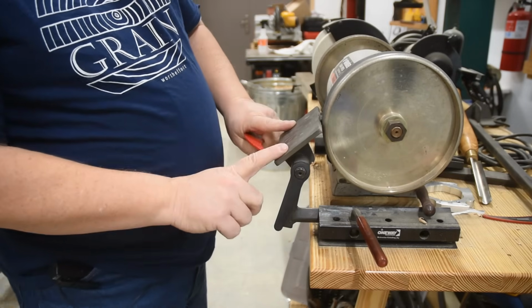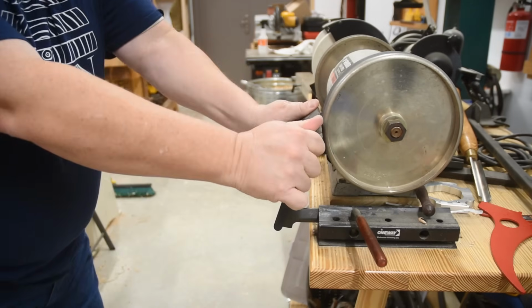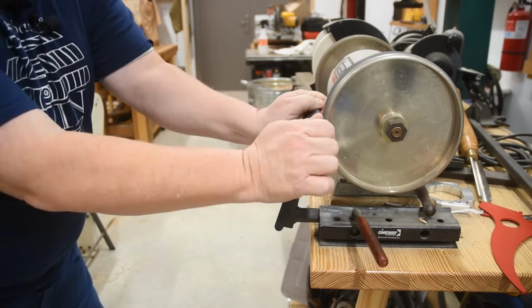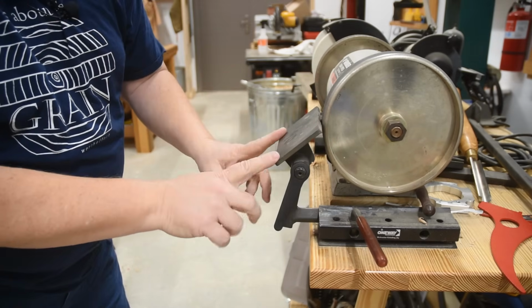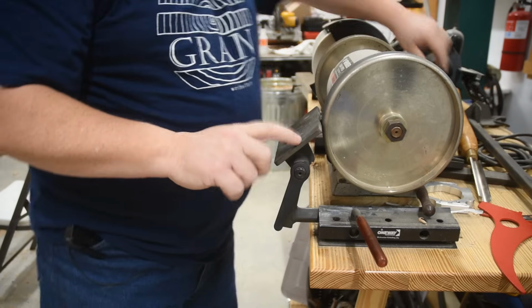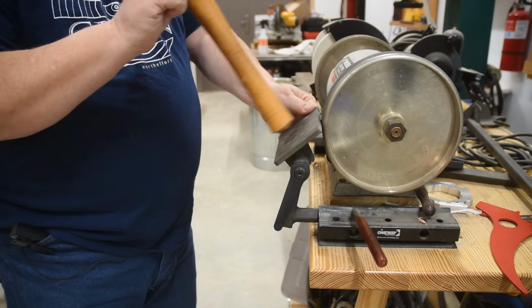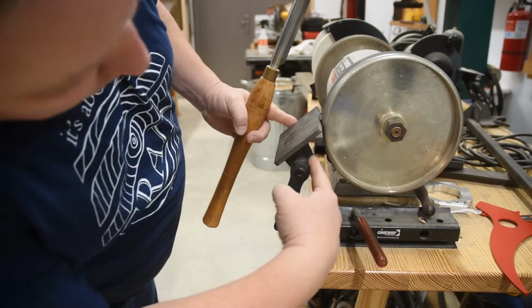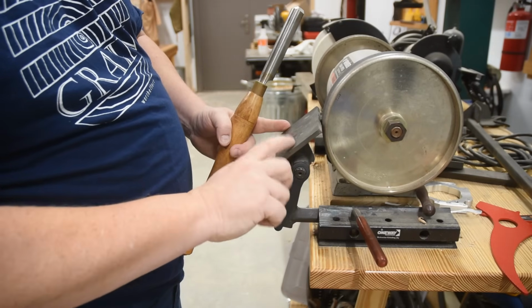And that's one of the things I like about this Wolverine, is it is sturdy enough that setting is going to stay for quite a long while. You can't say that about the other ones. FYI, if you ever have to micro adjust that, you can just kind of tap it here or here, because the pivot point is in the middle. That's your micro adjustment on these little ledges.